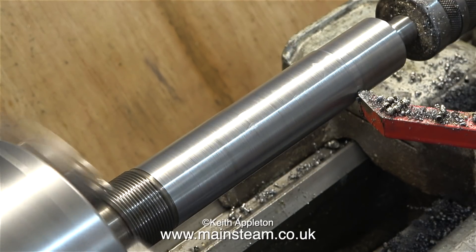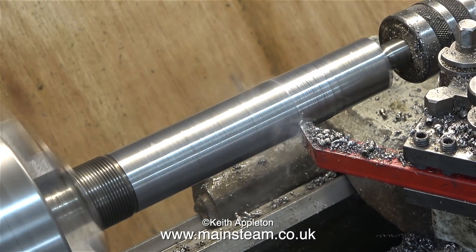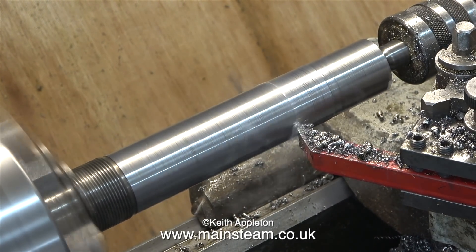How did I fix this, you may be thinking? In take two I speeded up the lathe and put less pressure on the belts and it seemed to work fine, although it was just on the edge the whole time.